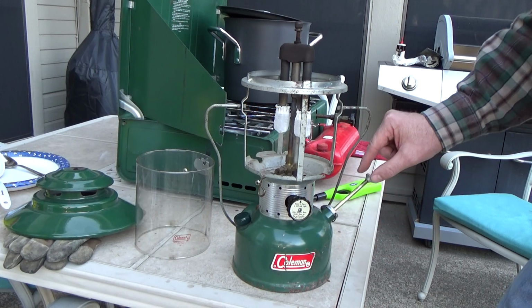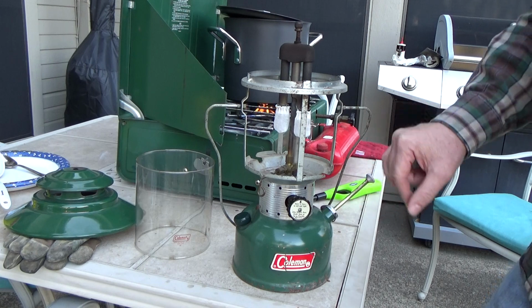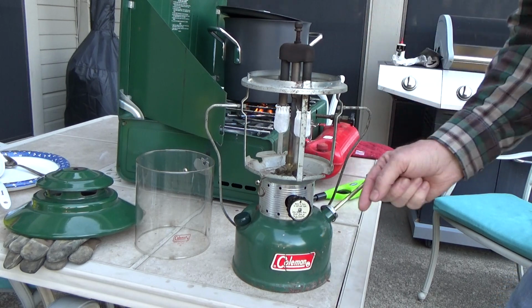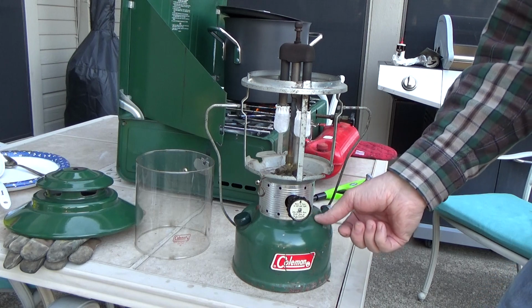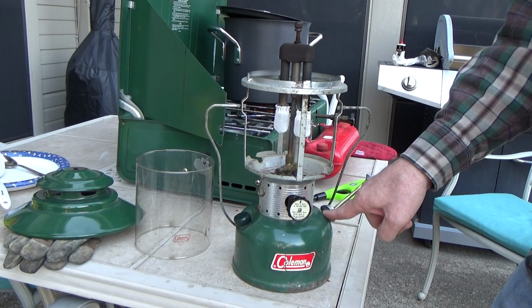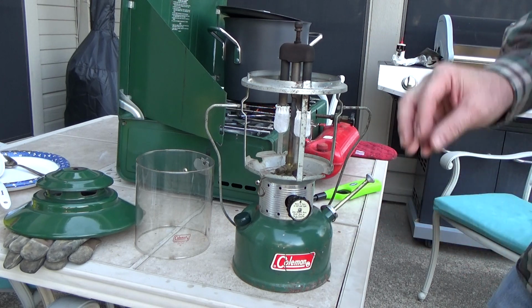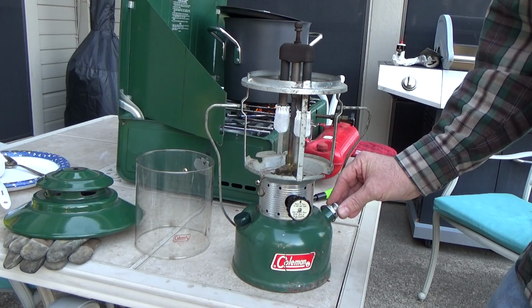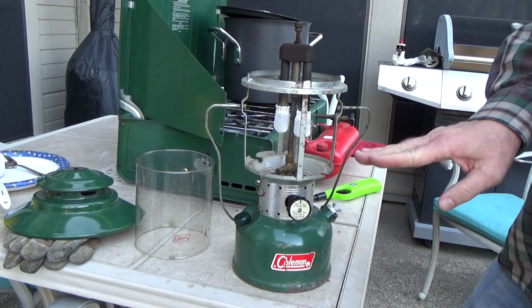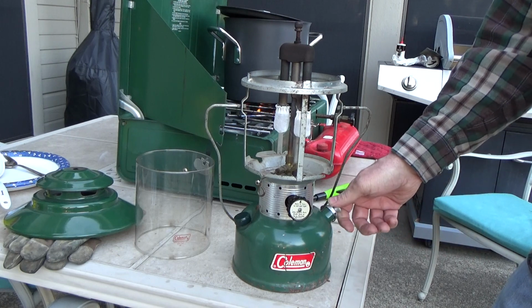So in here, this slides along a check valve rod. That rod is screwed into the check valve. The check valve's resting at the base of this little chamber that's going inside the fount. In that little check valve, they have a little steel ball bearing. When the pressure builds up in the fount, it pushes the ball bearing forward, and it helps prevent air and fuel from escaping out. As a secondary safety mechanism, if for some reason that little ball bearing fails or gets gummed up, whenever you push in and you're finished filling the fount with air, you would turn this all the way to the right, and it would screw in and shut off the check valve completely with the check valve rod. So two safety components.